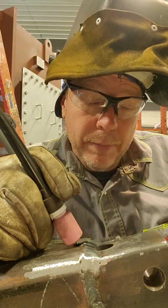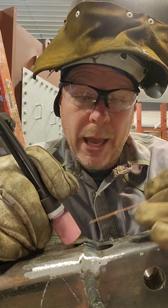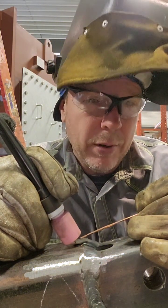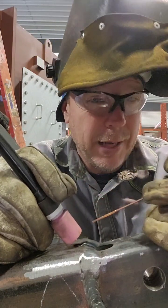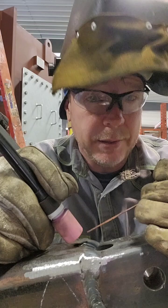You have to be very careful — you do not want the edge, the cutting flutes, the cutting part of the tap, to weld into the cut threads of the steel here, or else the tap will get stuck. It's done for.